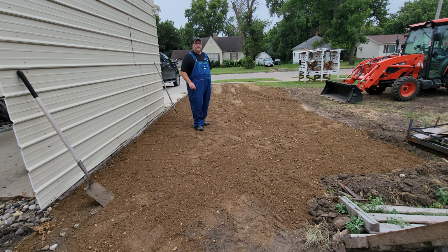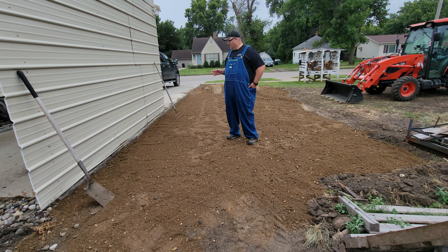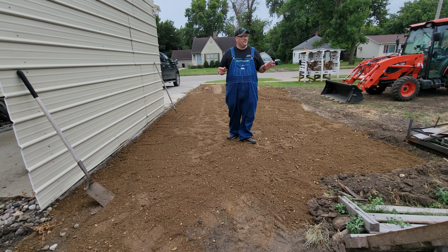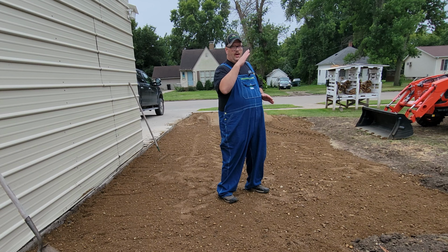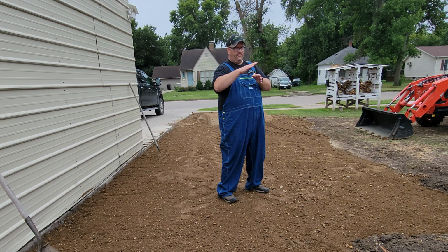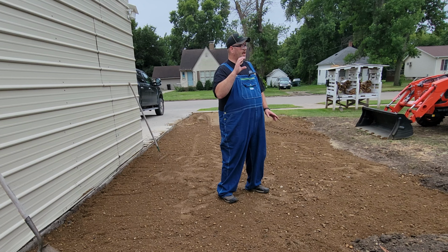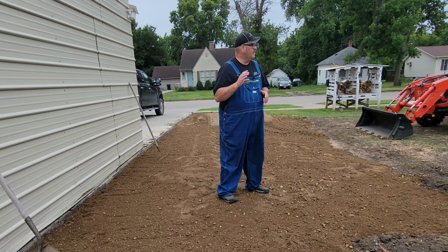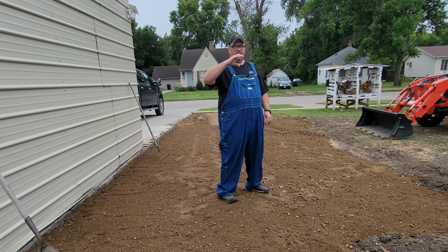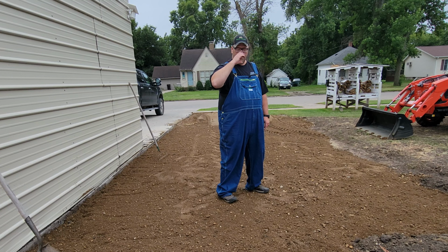But I do want to thank everyone for stopping in, watching this video. Like I said, I'm not an expert with the box blade. I know I have that angled way back. So if this is the front of the box blade, it's back like this. And that, from what I've learned, is better for spreading. If you wanted to dig, you go more like this. Then the scarifiers dig in more.